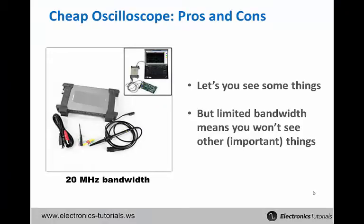In planning for this series of videos, I debated very seriously the topic of using or not using an oscilloscope. Do a quick search and you'll find plenty of devices that attach to your PC and make it into an oscilloscope. In the end, I decided this was better than nothing because actually seeing some power supply voltage waveforms really helps to understand them. But be aware that 20 MHz, even though it sounds high, isn't enough to see many of the so-called transient effects in power supplies — that means things that happen very quickly. So during these videos, we'll stick to things that happen mostly in steady state.